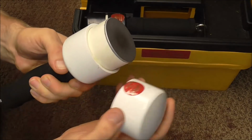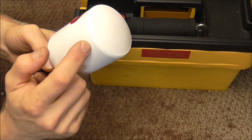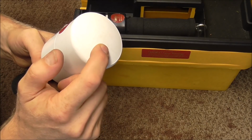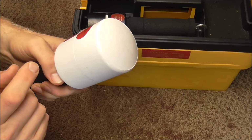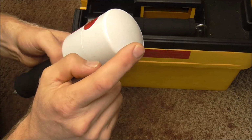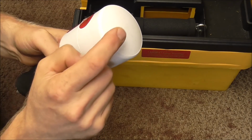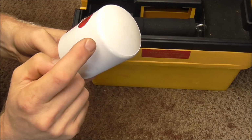These magnets have caps on them, and that's to help protect the magnet. It also gives a little more distance between the magnet and anything else that might stick to it. Another thing that determines the strength of the pull towards the magnet is how far away it is. The farther away, the less pull. The closer, the more pull. So if you can keep things a little farther away, there will be a lot less pull to the magnet.